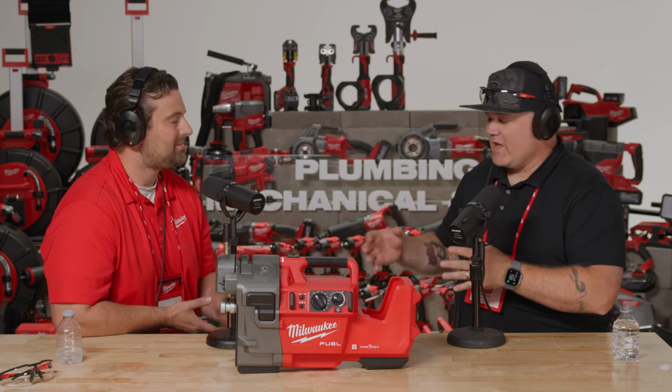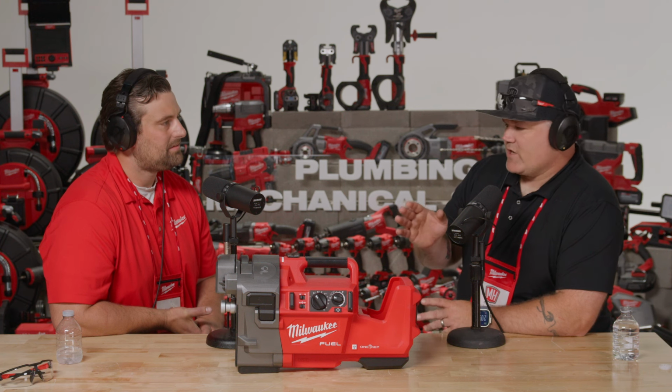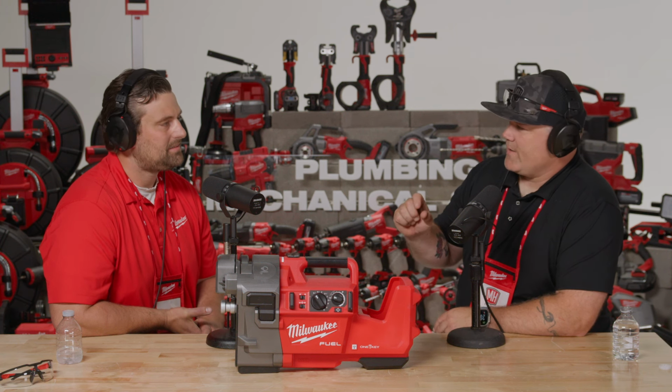Traditionally with pipe fitting and sprinkler fitting, this tool is looking at replacing a pipe threading machine used as a power head, and then an attachment accessory for the roll grooving. There are a lot of adjustments that are all manual. You've built into this machine dials with settings that are very easy to comprehend on how to set this up so you can get the proper depth roll grooving.